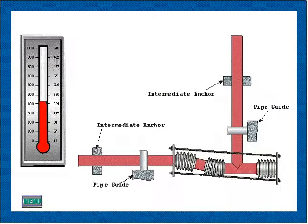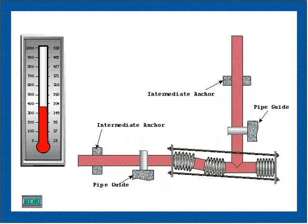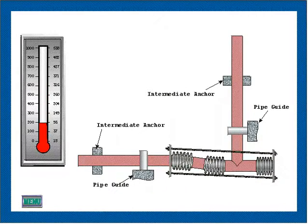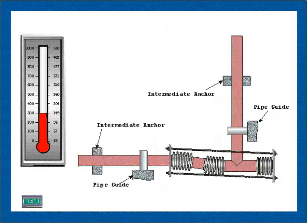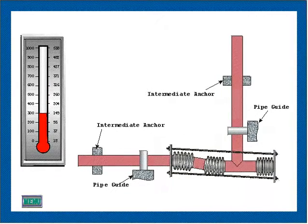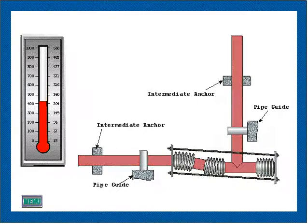In order for a pressure-balanced expansion joint to function properly, the pressure thrust restrained by the tie rods must exceed the axial movement forces of the expansion joint. In a large diameter, low pressure application, it may be impossible to utilize the pressure-balanced expansion joint to eliminate the pressure loading, or at best, the effect may be uncertain. In such cases, some other expansion joint design must be considered.